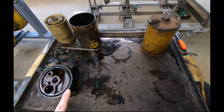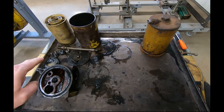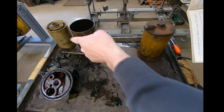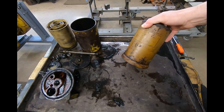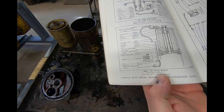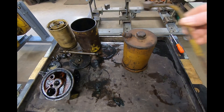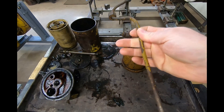With the filter base completely disassembled, everything from here over is what originally was 100% of the filtration capacity of these early D3 4100s. In the parts manual you can see at one time there was just a cap on top of the oil filter can, so basically those brass strainers were everything cleaning the oil being circulated throughout the engine. Now we get into the top piece — the 6B463 oil filter group, field installation for tractors 5J1 through 5J1496. That tube that comes off the top is the tube we did not put back onto the oil fill slash breather in the last episode.